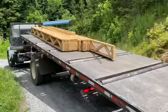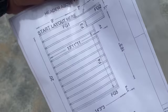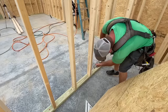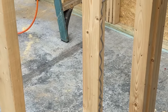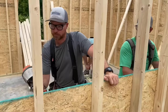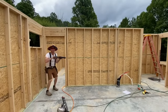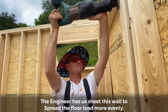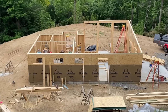These delivery trucks are pretty cool — they have a set of rollers that can be moved up or down to roll the load off the back of the truck. I was super happy to see these floor trusses, but after closer inspection of the drawings something was crazy. Turns out they had turned the trusses the opposite way than I had planned. On smaller projects there is a chance for mistakes because you think it's so simple you don't double check with the engineer — and I didn't. He ran these trusses through a wall I was not planning on being load bearing. We had to call a structural engineer and run the loads for our slab to make sure it would carry the load before carrying on. Luckily it did.